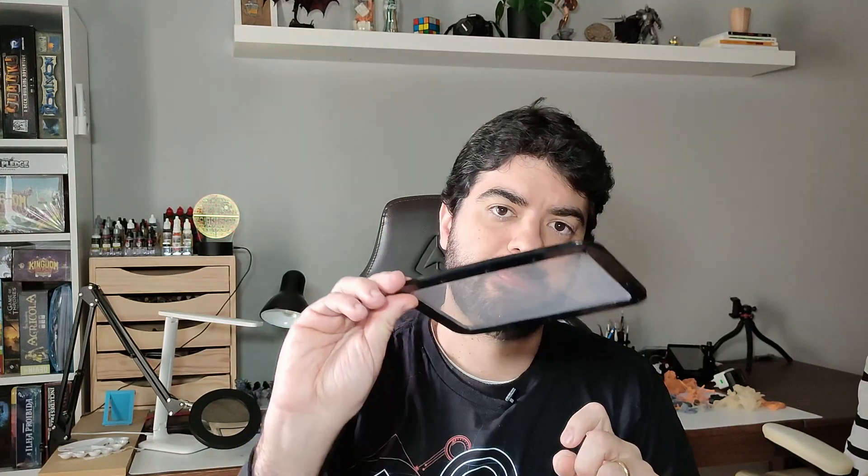But they have a very bad downside, which is you need to use the proprietary FEP frame — this plastic frame here. They do send one extra with the printer already, and as I say in my review, it's a good thing because it's easy to change the FEP. But on the other hand it leaves you with no alternative — you need to buy the specific frame. This is really something that I think keeps a lot of people from buying these printers.